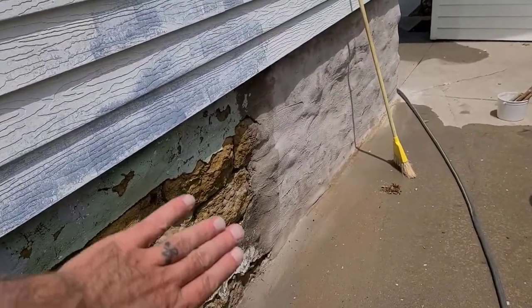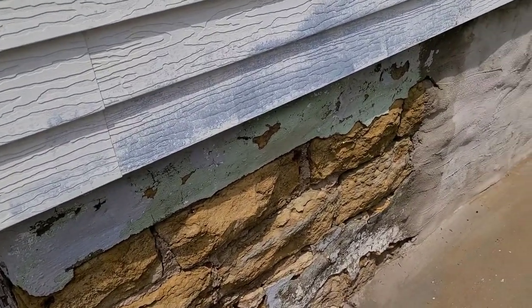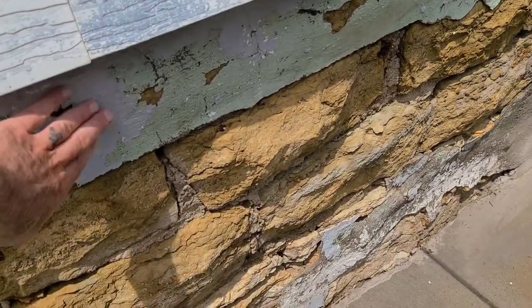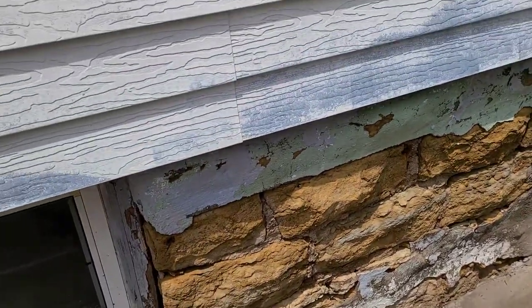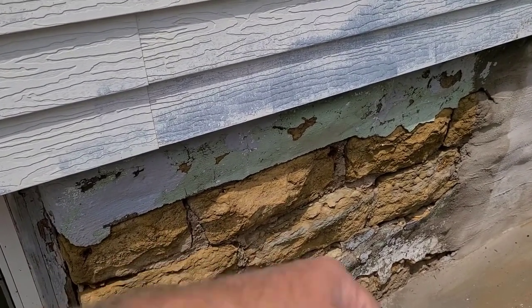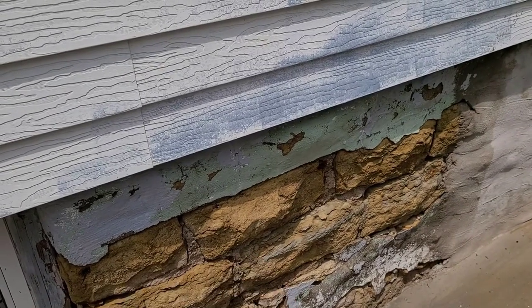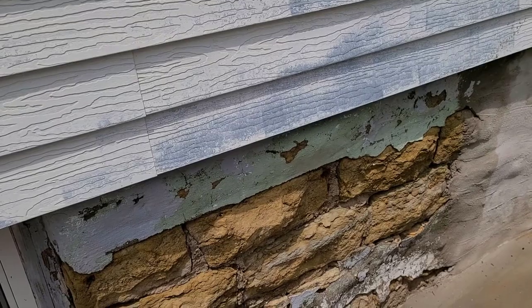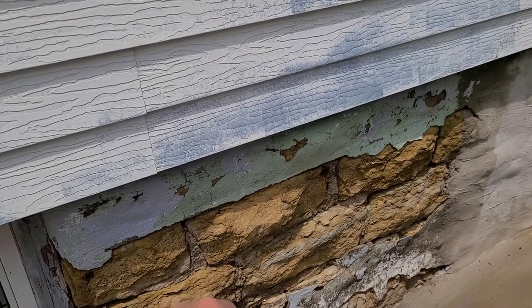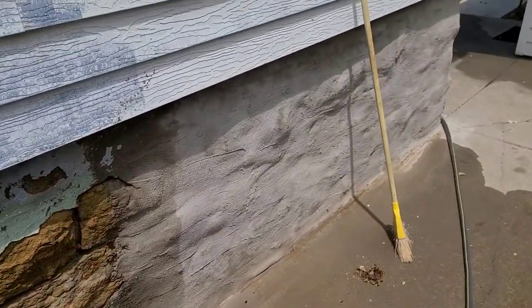The problem is the mortar they had on top - the stucco - is coming off. It didn't quite look like this originally; it was all painted. Then I went through with a claw hammer and tapped on it - you can almost hear if it's hollow or loose when you tap. If it was loose I'd take the claw of the hammer, and I also had a masonry chisel, and I knocked off all the bad stuff.